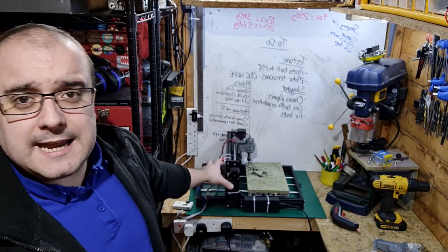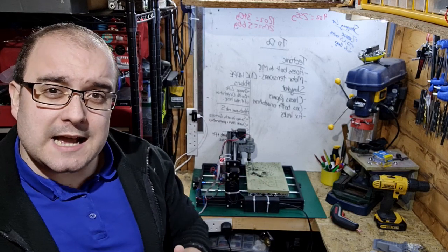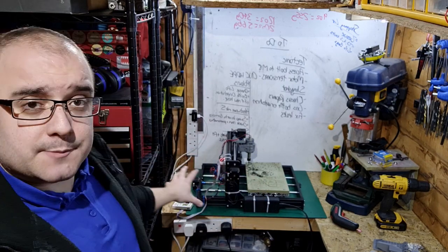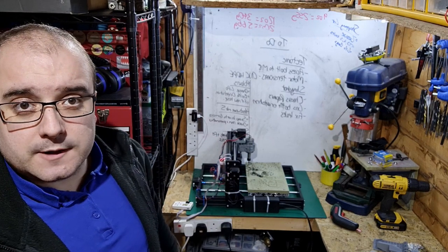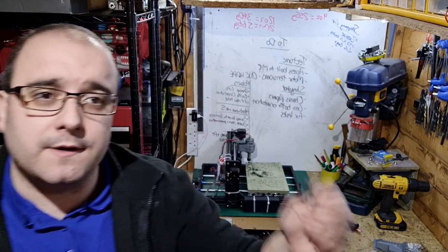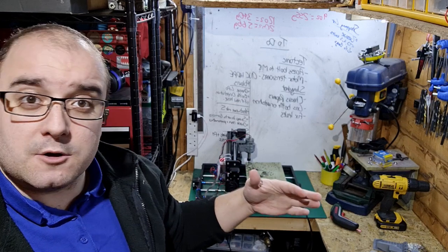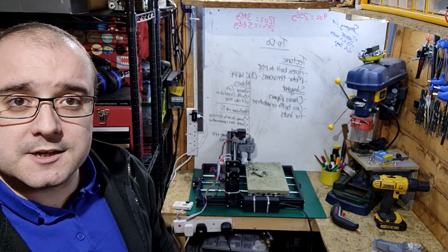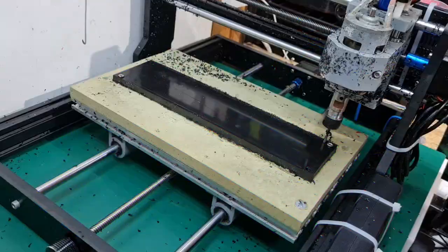I use then the eCam software. It's something you can get for free if you're using it at a weekend as a hobbyist. And I use that to program it and create all the G-code using the files that I've created on SolidWorks. Lovely little machine. You get all your files onto it by downloading them to an SD card, and then you can turn flat pieces of material into your highly complex shapes. So let's give this a go and start building some bits.